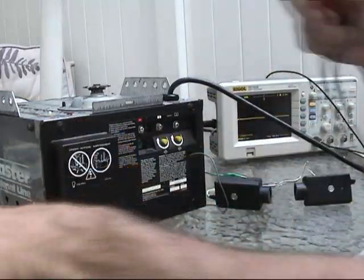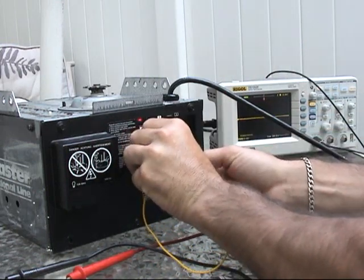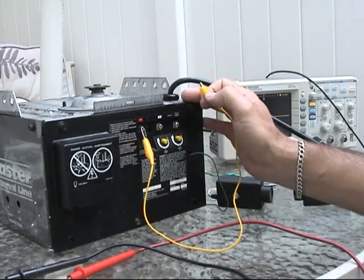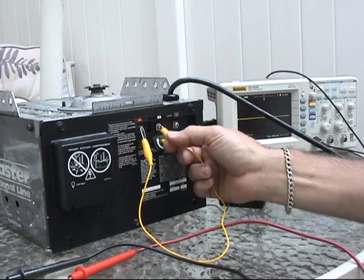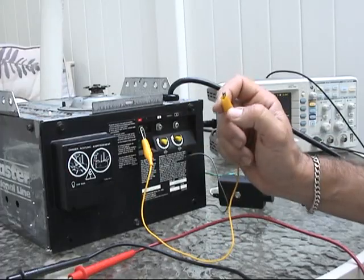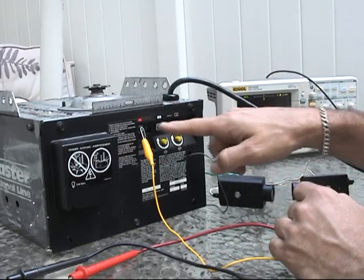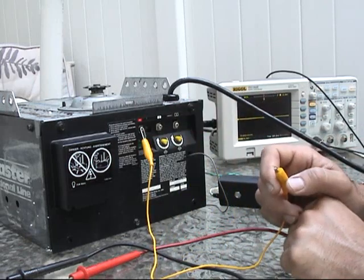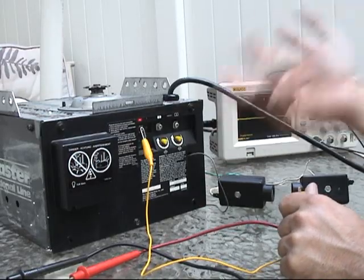In order to open and close the garage door, you have to put a jumper between one and two. So we do this, and the garage door starts to work. The garage door went up. Now I'm trying to close the garage door, and because there is no sensor connected between two and three, it's not working. When I try to jump it to go up, to go down, it doesn't get the signal from the sensor and comes back up again.